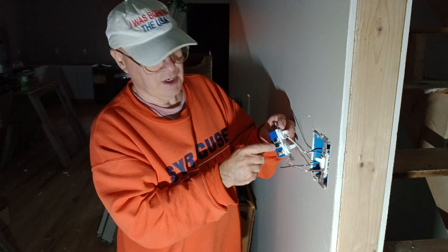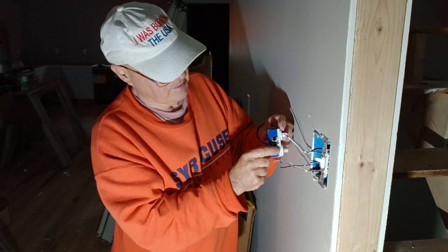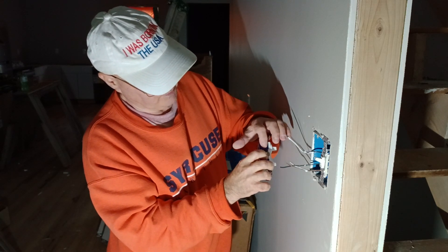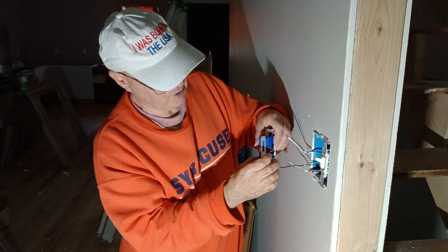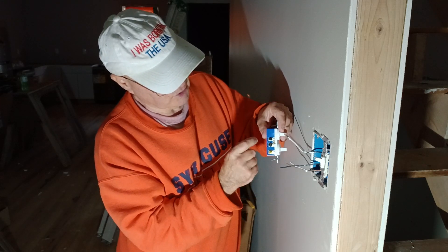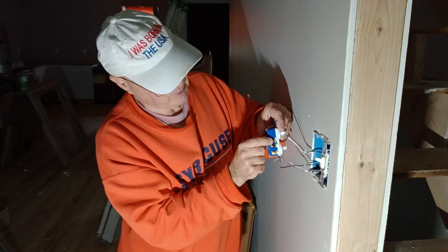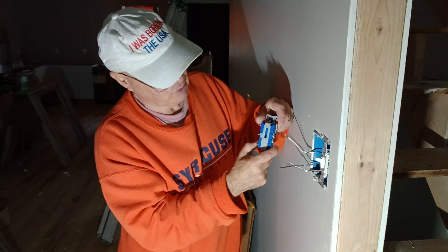If you're doing two switches on two separate circuits, you'd break this little tab off. This would be one switch from here to here, and from here to here, and they could be on two different circuits if you break this little tab out. But if you're wiring this one as a three-way on one circuit, you'd break this little tab out again — that's your common and your two travelers. This would be your single pole switch up here. But with the tab in, we're doing two single pole switches.